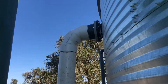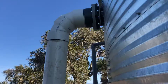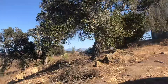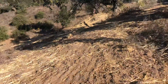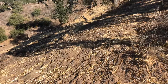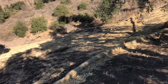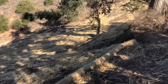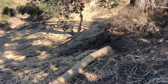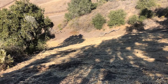We have three well pumps running into this tank and we didn't want any problems with erosion. We'd had a problem when one of the other tanks overflowed and washed out a couple thousand yards of dirt from the slope — it had to be rebuilt, and we now have erosion control set up to get established again. That washout caused thousands and thousands of dollars of repair work. It was a well pump running at 400 to 500 gallons per minute overflowing down the slope.